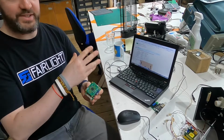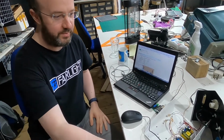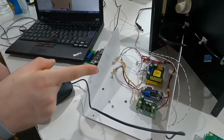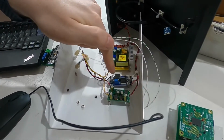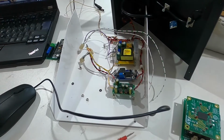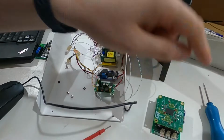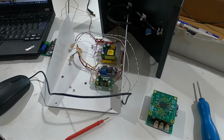Once I had that in place and the software was reprogrammed to make use of the new pin layout, that was ready. I could put that aside. We tested the power supplies. This one, the 80 volt generator. This one, it's the 5 volts. And this one for plus or minus 12 for the keyboard. Mm-hmm. And the plus 12 derived from this module powers the H-bridge as well. So all voltages are needed really if you want to send.